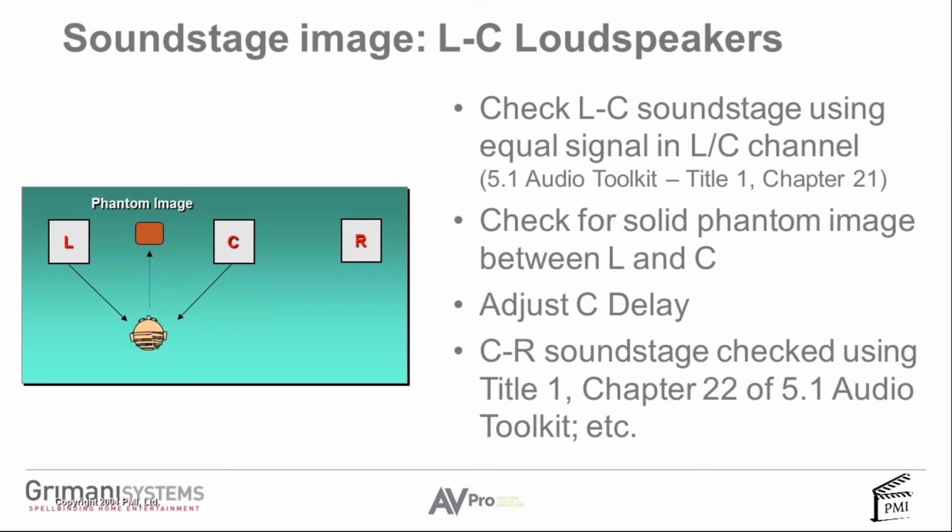So you could call it phase. Phase is one part of the time response. It's the whole thing, the whole impulse character of it is all correct. Now, yes, the relationship to the subwoofer may change if you had done the splice from before, so you may need to go back and check how you're interfacing the delay to the subwoofer correctly.